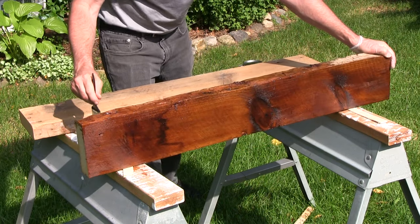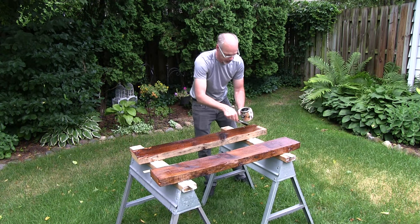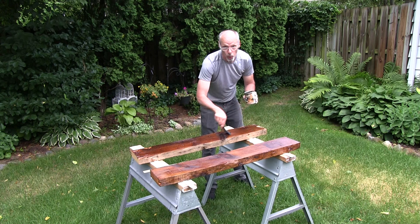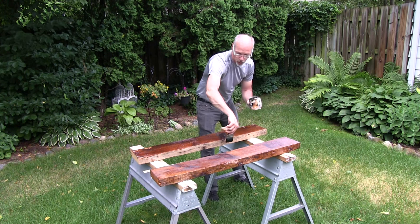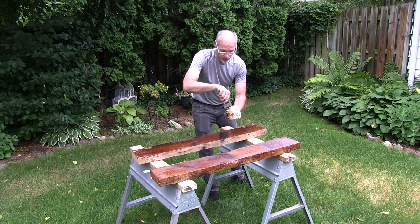I love this stuff — it makes the wood just look beautiful. Again I'm putting this on way thicker and brushing it in way more than they suggest, but it's working because there's so much texture here it's soaking it in and going into these holes and cracks. Don't let it go on the sides and sit there, because then when that dries and you put more on to do the side, it can be a little bit of a different color.